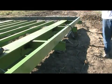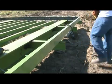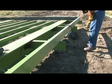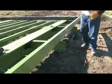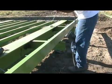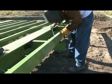After your ends are in place, you can then set the sides. This particular scale was designed to have posts put on the end of the outriggers. Most truck scales will have the outriggers level with the deck edge. Typically, you would use a straight line to make sure it is straight. Once you are sure of the positioning, weld it in place.